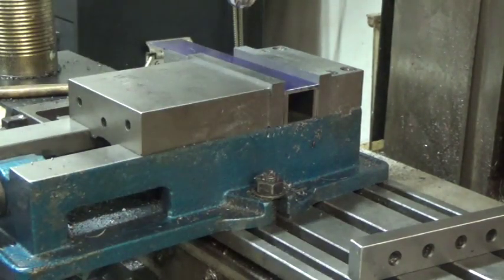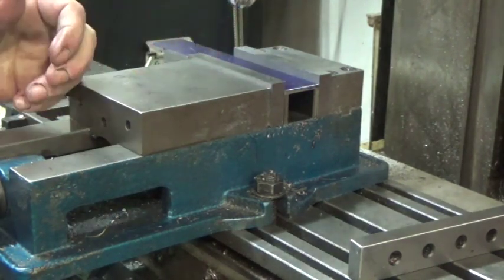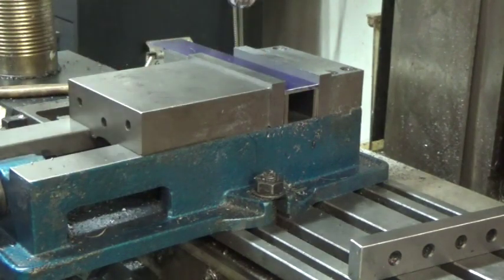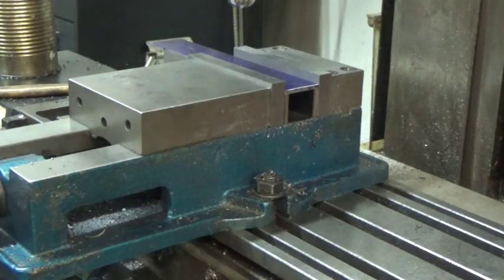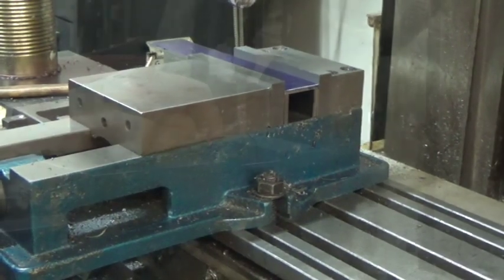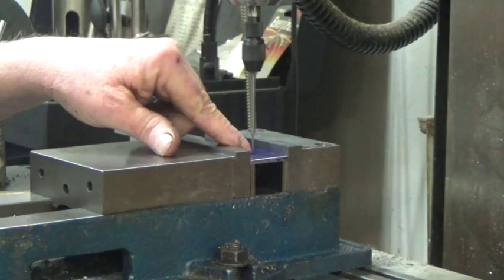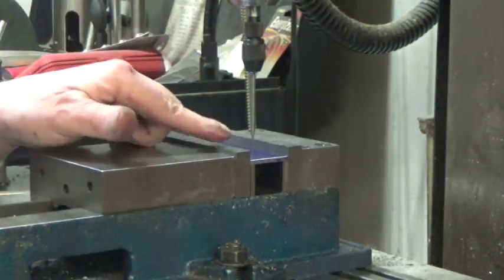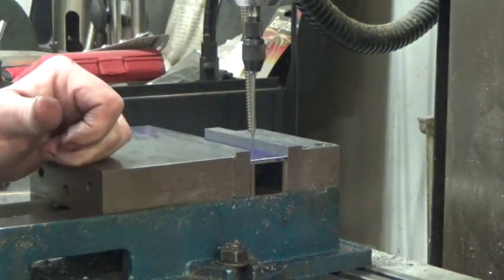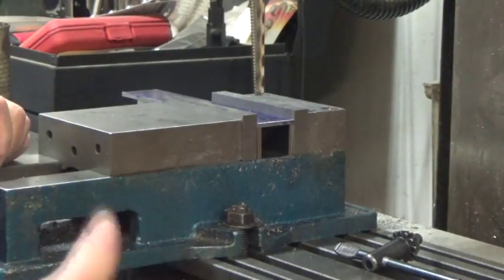I snug the vise and tap it down. This is an angle-lock vise, but it's just habit to give it that tap to make sure everything's down on the parallels. Then I knock the parallels out of the way because I'll be going through with drill bits and ultimately a boring bar, and I don't want to strike them. I'm going to get set up with a wiggler to locate our center punch and show you the different steps for making a one-inch hole neatly on a small milling machine. I located center using the wiggler on my center punch mark — my eye is good enough for this.